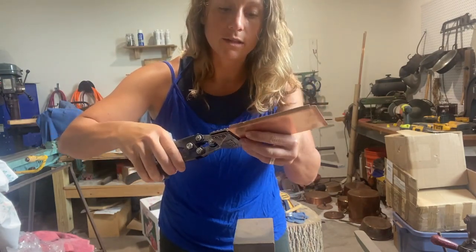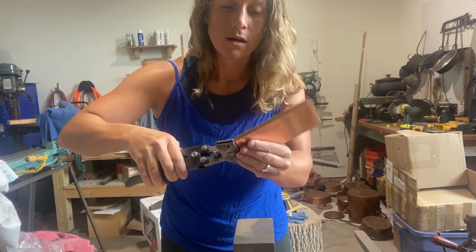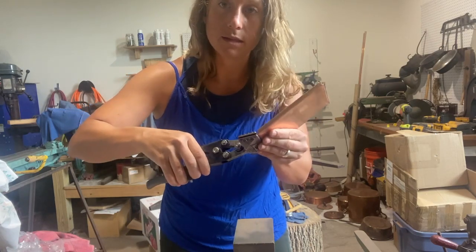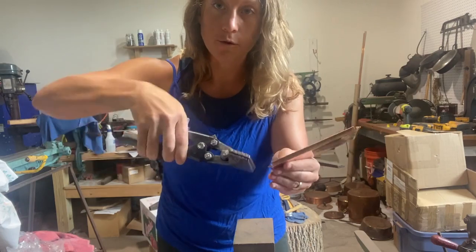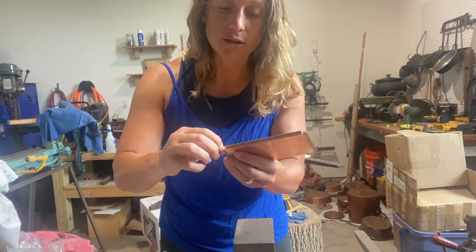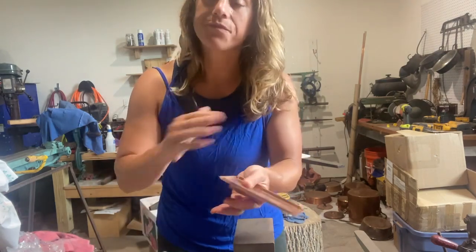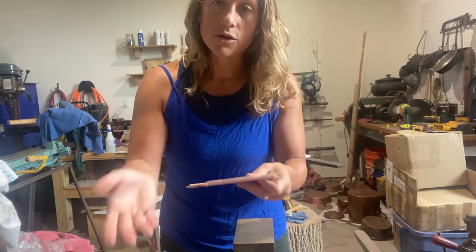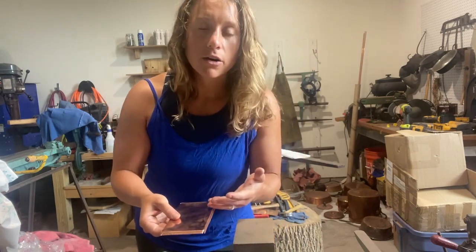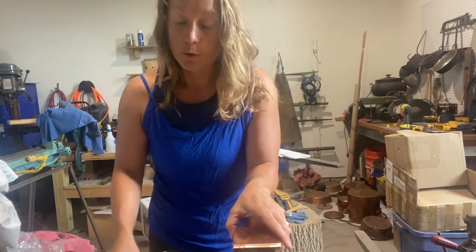It's just small enough that I don't think it's gonna work, but you get the idea - you take this in and bend it up the full 90 degrees and it'll go really easy for you. I put my edges a little too much, which is fine, but you'd use that tool if the length of your face allows it, and you just bend it up. The crease you've already made will make that job way easier - even though you've work-hardened the copper, the bend is already predisposed to bend back.